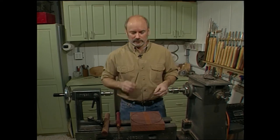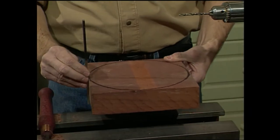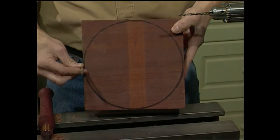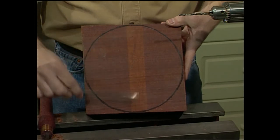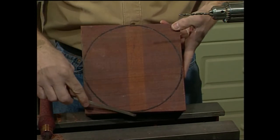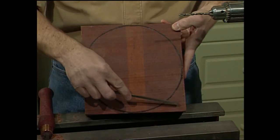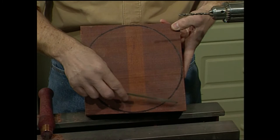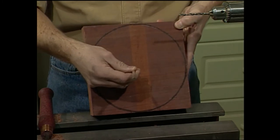What size hole do you drill? Here's my tool steel — if I drill a hole that is the width of the tool steel, that's exactly what I want to do. These sides are barely touching as they go in the hole, but these edges cut into the wood as I pound it in. That prevents the steel from twisting in the handle and gives it a beautiful tight fit.